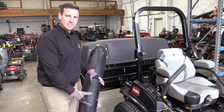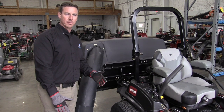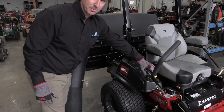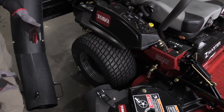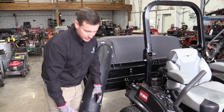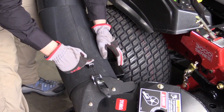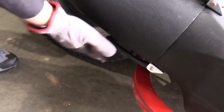After removing the pipe housing from the blower, reach in and inspect to make sure there's no debris stuck in the blower engine and fan. Make sure you have your safety gloves on, the engine is off, and the blades are disengaged. Make sure your brake is set so the mower does not roll away from you. To reinstall the tube, pull the tube back to the main housing, push it on, line up the latch, and be sure both latches are engaged.